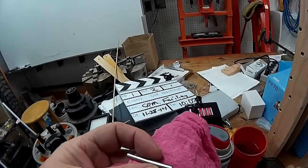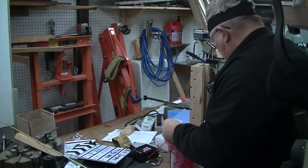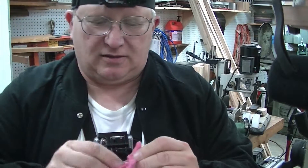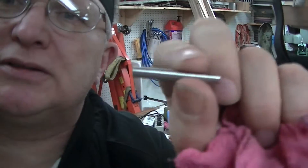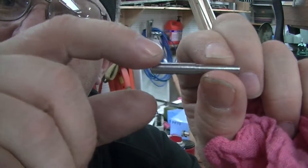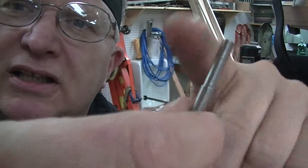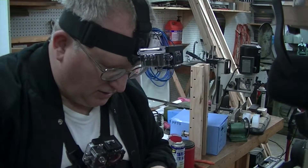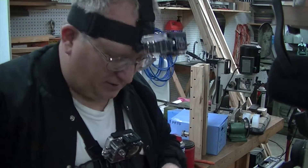Apparently it didn't like being cut like that. Let's put some fat and some water on it real quick — man, that was hot. So here's what we have to this point: a little straight piece with two diameters, 216 and 184. We don't care about the lengths at this point. Now we need to grind that off at a 45-degree angle in the surface grinder, and that's going to be another setup. Here we go — I've got to break down now and move all my cameras over there and set up for that next shot.